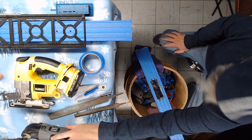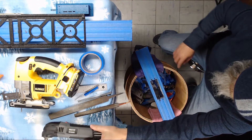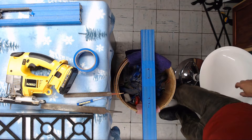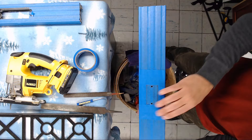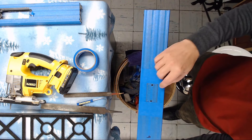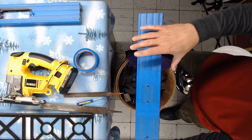Tomorrow — because this needs to cool down some more — I'll cut the other piece. Now I'm going to try and cut out the second hole here. As you can see I put a couple extra layers of tape because I want to be really careful I don't skip over and mess up the anodizing. I'm going to try and cut through this top layer here first and I'm hoping I can plunge cut through the rest of this.